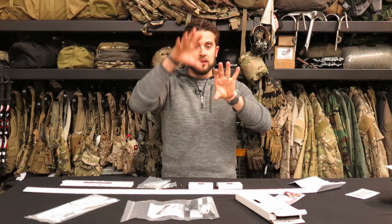There's a couple of screws and the plate that actually is in the frame, and then there's the actual deadbolt that goes through there. The lock mechanism where the deadbolt is typically isn't going to give way on the door side. It's going to be on the frame side, and it'll splinter and doors get kicked in that way. That's most commonly in residential door frames and things like that.